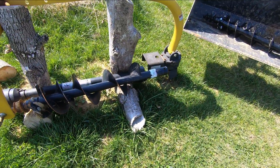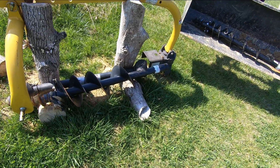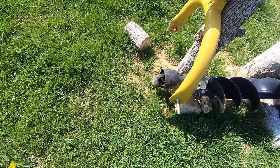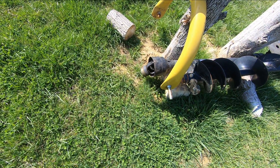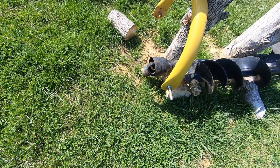Got to put oil on that thing — it does leak a little bit, so you've got to add oil to the head almost every time. If you don't, you still have to check it and make sure it's good. These shrouds that they put on where the PTO goes on are supposed to protect it and keep the brush out, but in all actuality it doesn't. All it does is make it more difficult to put the thing on the tractor.